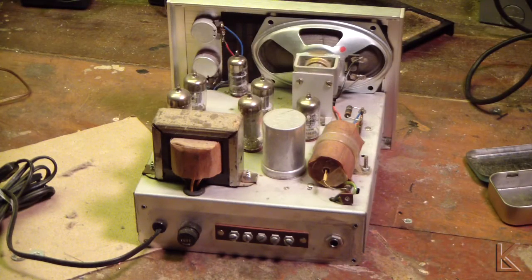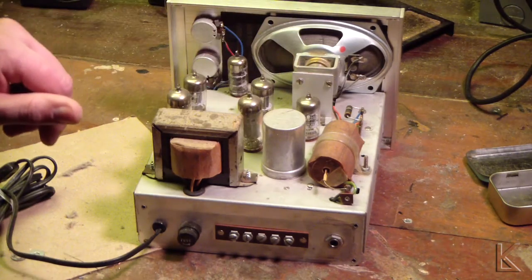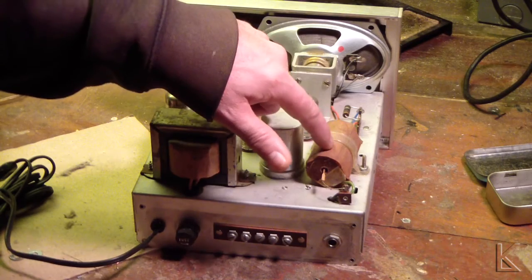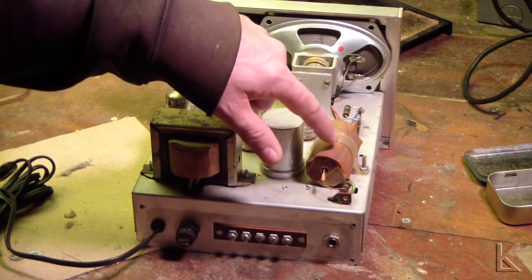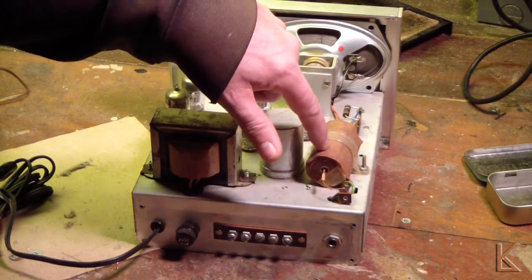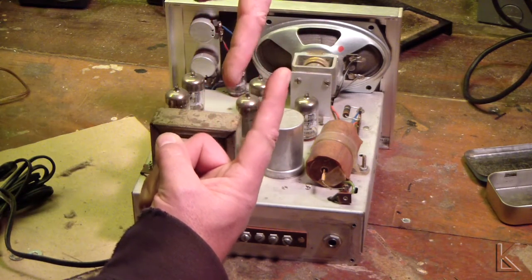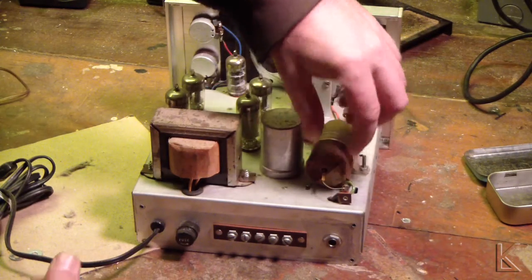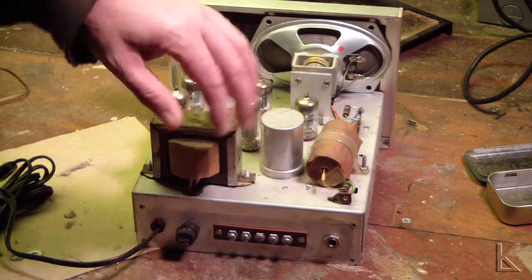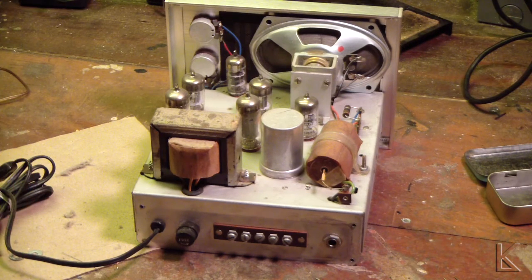This is an interesting piece of gear. We've got one, two, three, four, five, six tubes. This is obviously the power transformer. This caught my eye — you know what this is? This is a reed relay, a very early reed relay. Inside of here is a glass tube with two ferrous metal pins with silver contacts, close to each other but not quite touching. When the coil is energized, it creates a magnetic field which draws the two pieces of metal together — and that's your relay contacts. I've never seen one of those ever.